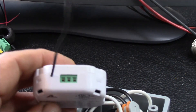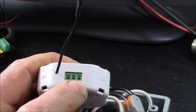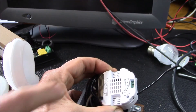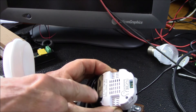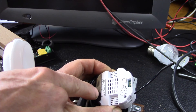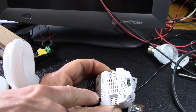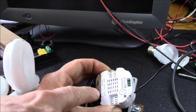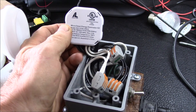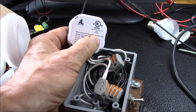A note about wire sizes: the switch terminals work with 18-gauge wire, so they're quite small. For the line and load terminals, 14-gauge is about the largest you can fit. If you're using this on a 20-amp circuit which requires 12-gauge wire, you'll need pigtails. 14 just barely fits, and 16 actually fits a lot better — that's what I used.